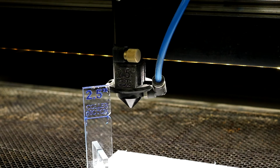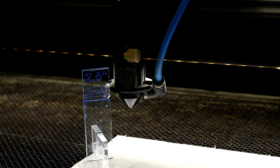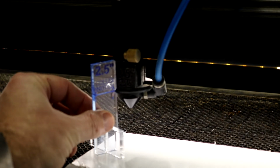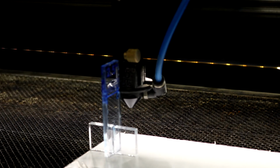It doesn't really matter. And so the idea here is that on our controller, usually I start with fast Z. So we'll hit that first button on the left about 3 times to get to the fast Z mode. And then we'll use the up and down arrows in order to raise and lower the bed. And so you want to take slow movements here until you get close. And what we're looking for is that notch to be right on the edge there.